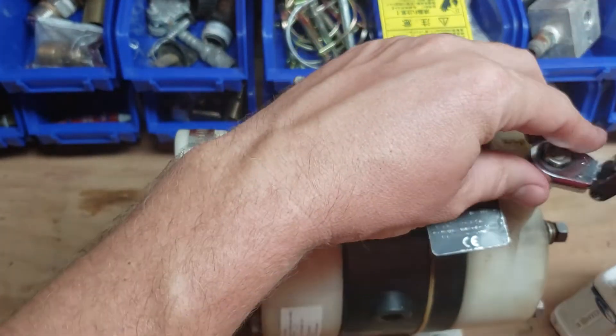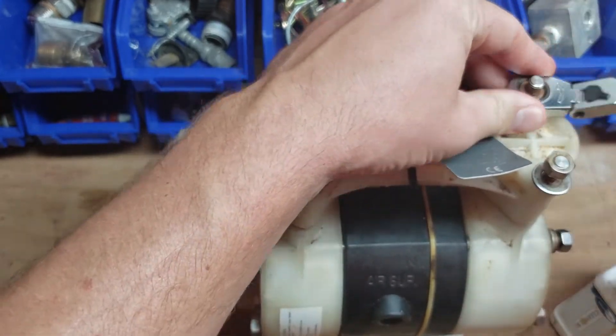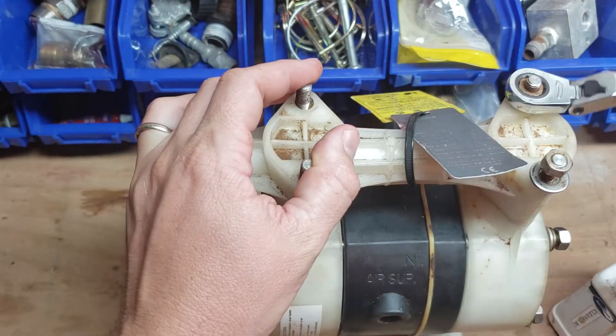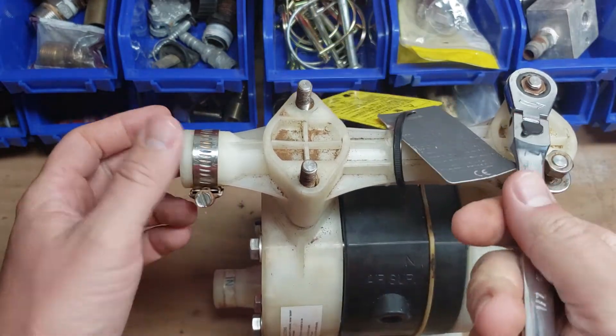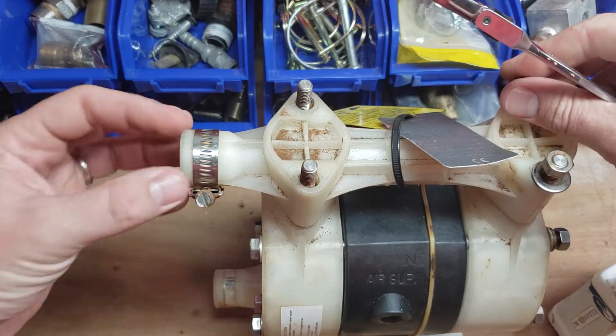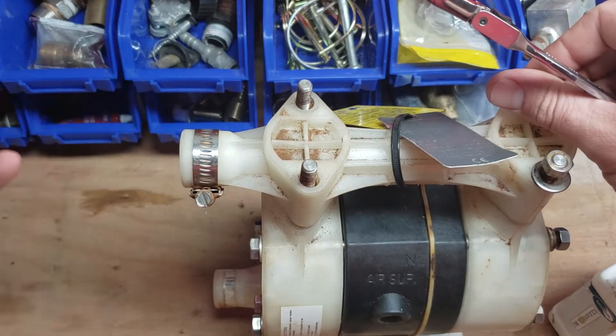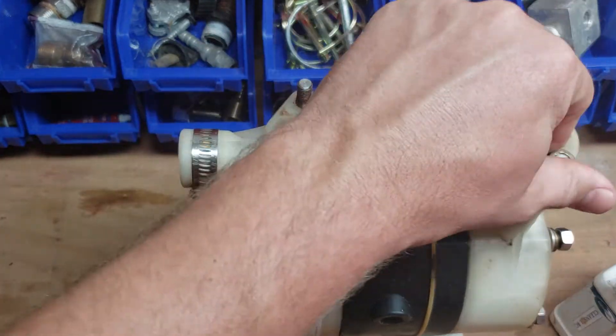Plastic components being plastic, eventually plastic just doesn't last forever. But if you're having issues in the course of using it, check right here. What we do is we basically put banjo fittings right here and then we cam lock onto that fitting, so it's quick, easy off, easy on on both setups.